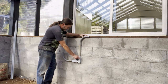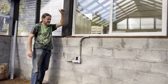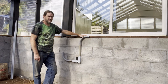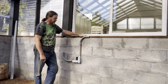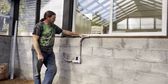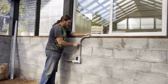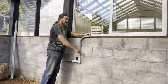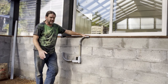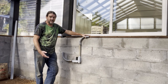Anyhow, this is one-inch conduit I got fed through the walls. This one here is going to go up this post and across the roof up there, and that'll put some outlets up there for our heaters. I know they say heat rises — I probably should have it down here — but we're going to try it up there. And then this one here will supply some outlets along this ridge all the way around, for heat mats, a fan, lights, or anything you want.